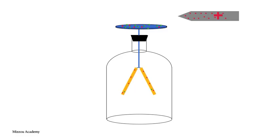So when an electroscope is near any charged object and develops a charge on top — negative in this example — and the opposite charge on the bottom — positive in this example — then we say that it has become polarized. A polarized electroscope can be recognized because the leaves will move apart. When you bring the charged object in, the electroscope becomes polarized and the leaves move apart; move the charged object away, the electroscope becomes unpolarized and the leaves fall back down again.